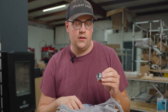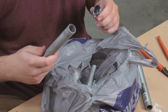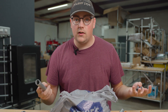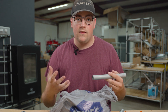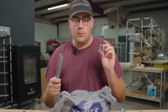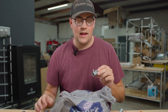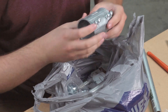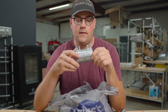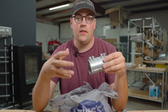That brings up a good point: you want to make sure you're paying attention not only to the type of conduit, but also to the size. All of this is for EMT conduit, which is smooth on the end, and all these fittings and accessories are designed for that. Whereas rigid conduit has threaded ends, with specific threaded couplings and fittings. You want to make sure to get not only EMT conduit and the appropriate accessories, but also match up the size. For example, this is for half-inch EMT conduit and half-inch flexible metal conduit. This other coupling here is made for two-inch conduit — same idea, get the right size.